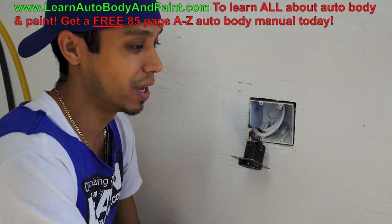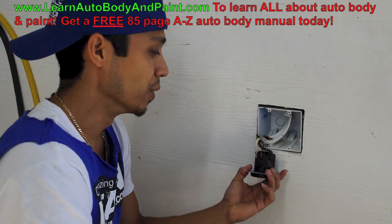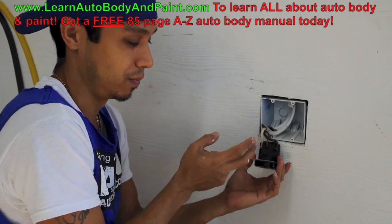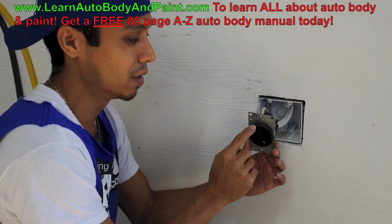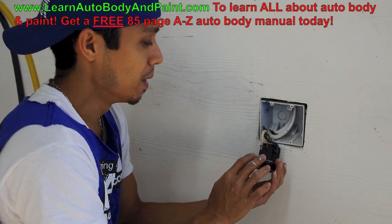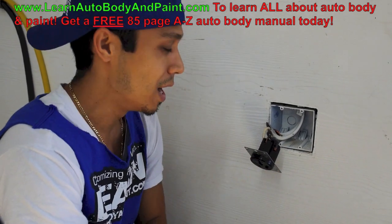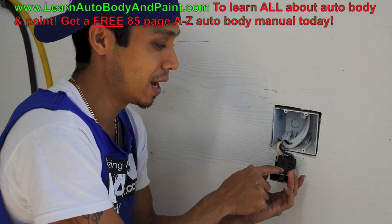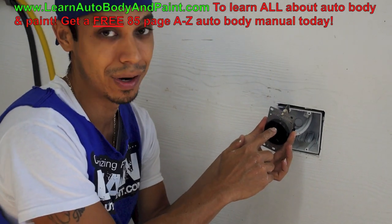Basically, the compressor was getting only 110 volts, half the volts of what it's supposed to get. So when the guy came, all he did was change the white and the ground out, putting the two hots on these two and the ground here. I mean, it was common sense. I obviously should have known that, but next time I know, right? I'm not an electrician, I don't do this all the time. And I goofed, and I really thought that because it said white here, the white had to be on this thing here, although usually this one is the ground.